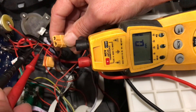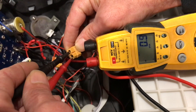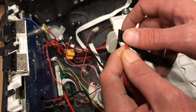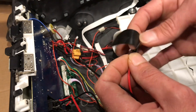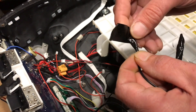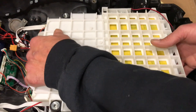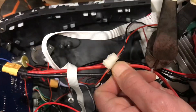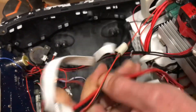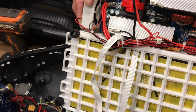Here's the DC lead off of the battery pack going to the inverter and to the control board. I'm going to put the meter in DC and just check — make sure it's safe. No voltage present, so I'm going to continue disassembly. Just in case something wants to go hot while I've got my hands in here, I'm using electrical tape — I'm not wasting a butt splice to cap these because this is not going back together. The battery pack and inverter seem ready to come out. More zip ties to cut to get the wires freed up. Everything's loose now, and there's the battery pack and stuff — so let's go over it.